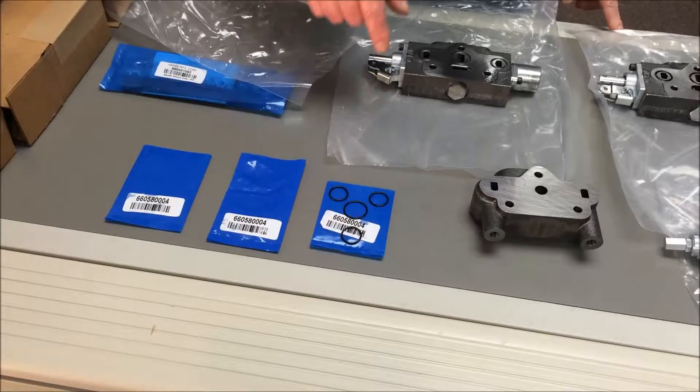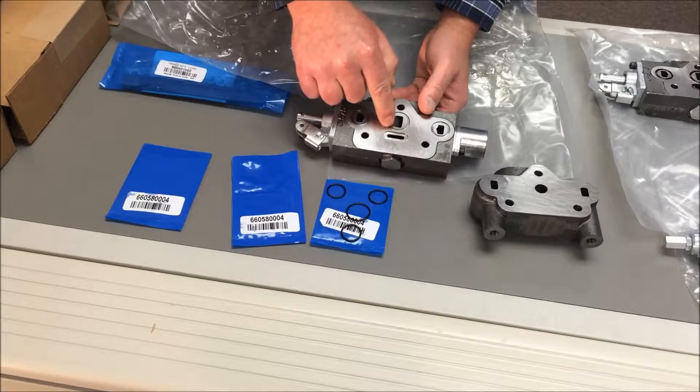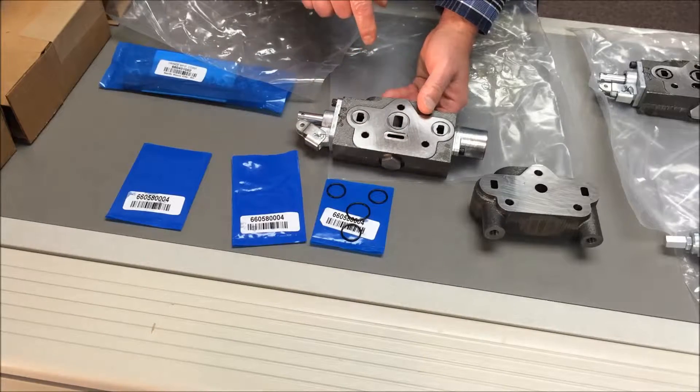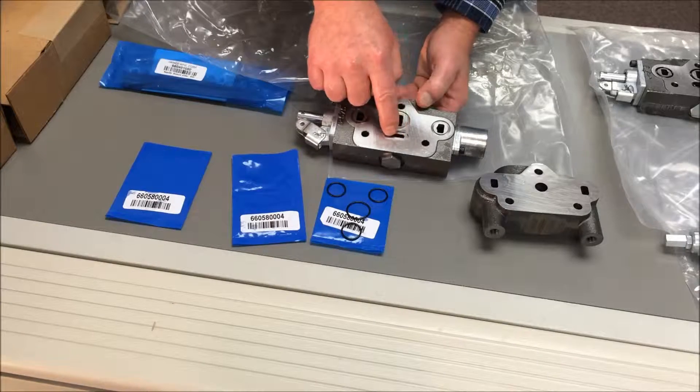For the SV family, the larger O-ring goes in the round center groove, and one of the smaller rings is reoriented to fit in the racetrack groove. The Series 20 family has O-rings of uniform size. There may be extra O-rings in the kits you receive.